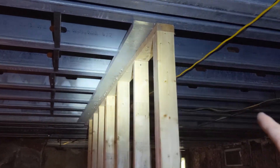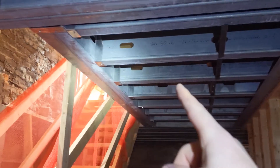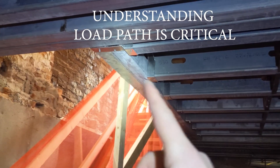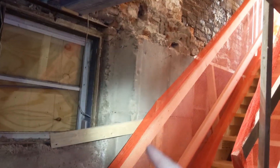This wall is probably temporary and going to be removed. But once it's removed, this double joist is going to be supporting this entire area. What they do is put a double joist here so all the load from this area comes down these joists, hits this double joist, travels across, hits down there, and then goes into the foundation wall. That's a steel lintel that goes down to the foundation — it all flows down and we're good.